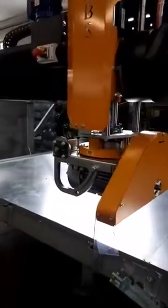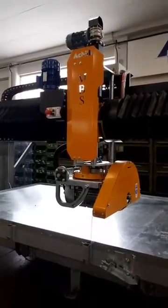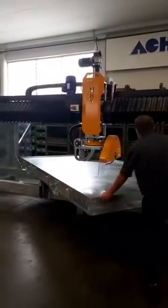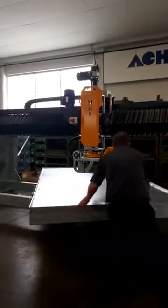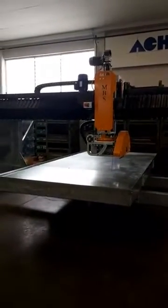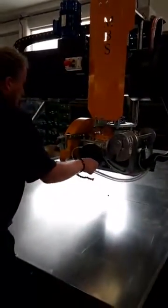In order to be able to cut a diagonal in all other directions, he asked for a turntable. The rotation of the table is manual, with pneumatic brake positioned at all degrees and positive locks at plus/minus 180, plus/minus 90, plus/minus 45, and 0 degrees. For miter cuts, the blade can be tilted manually to 45 degrees by handwheel, so as to perform miter cutting on both the X and Y axis.